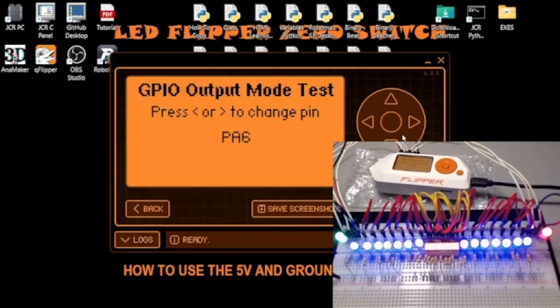This is how you can operate your Flipper Zero as if it were a battery and make a whole bunch of LEDs light up. The other GPIOs I used for the RGBs have built-in pull-up and pull-down resistors, similar to a Raspberry Pi where you can plug LEDs into a breadboard without external resistors. But I like using them because someone needs to use resistors in real life.